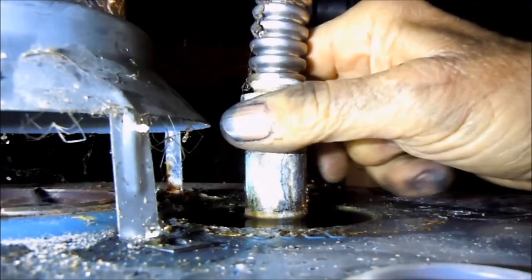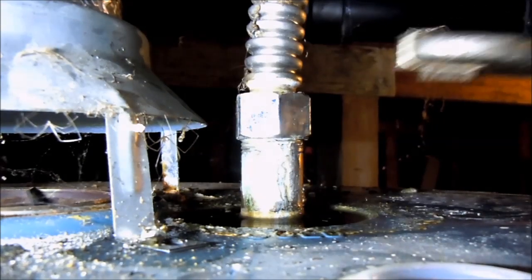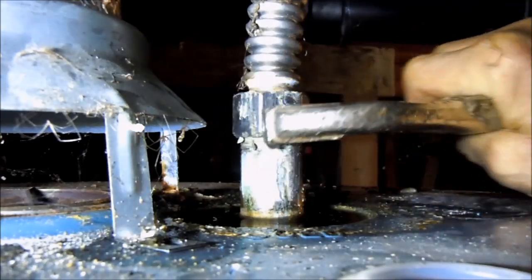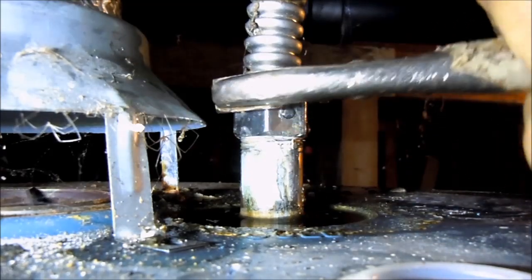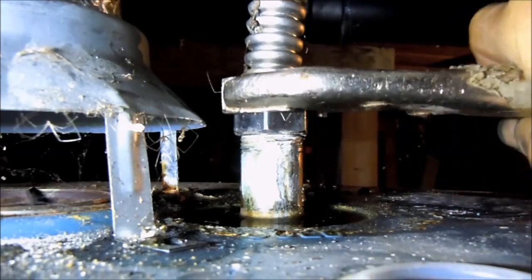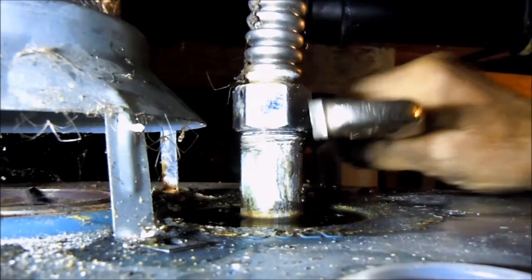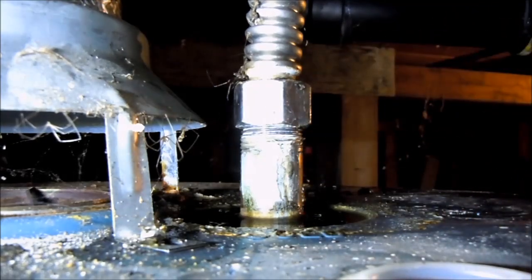This one I'm going to tackle. I thought maybe just half a turn would do it, but no — half a turn made it start to leak a lot more. I actually took it off already and put plumber's tape on it and that didn't work. So what I did is I got some pipe goop and new washers. We're going to try and take the old washer out and put a new washer in, tape it up real good, and see what we can do.